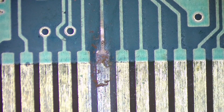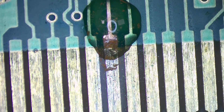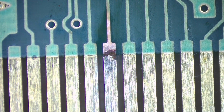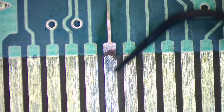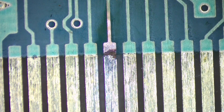You can see the corrosion coming off there. I'll put some white vinegar on to try and get rid of the rust. Now you can see where the copper disappears - and that's a complete break from here to here. So we'll just put a little jumper from this side to this side and see if that fixes it.